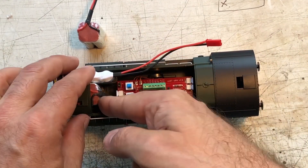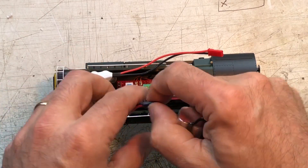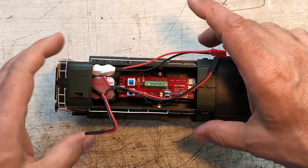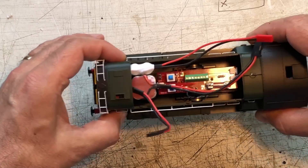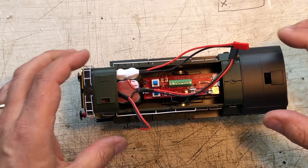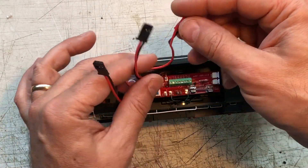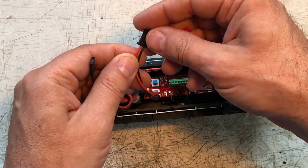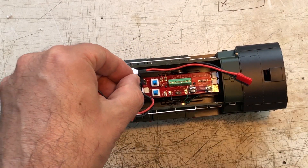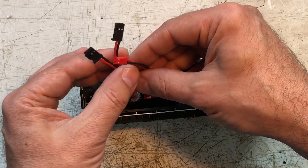I need to get that one at the back there. That's two in and then another one goes to the front. These are quite snug — not going to go anywhere. Once they're in there, they don't wander about the inside at all or touch anything they shouldn't. Then we've got three cables here; any one of these plugs is the right pin pitch to go on the battery connector which is just here, because you've got to connect them up in series to make them into one 14.4 volt pack.